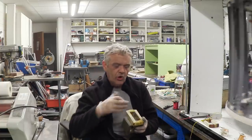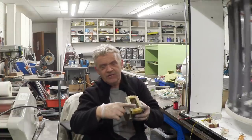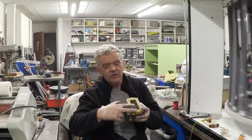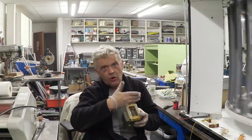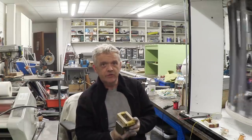And it's the same with the coil. When you put it on, the coil goes under only to about that far. Makes no difference if you put it all under or halfway under. It's just that the magnets need to pass in their entirety over the coil, so the rest of the coil, which isn't under the influence of the magnet, is clearly a waste of coil.